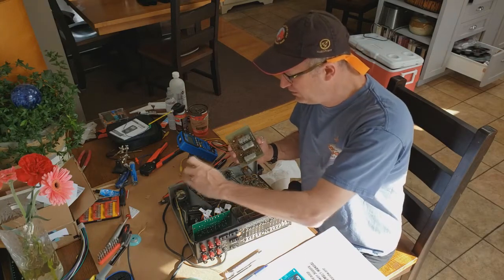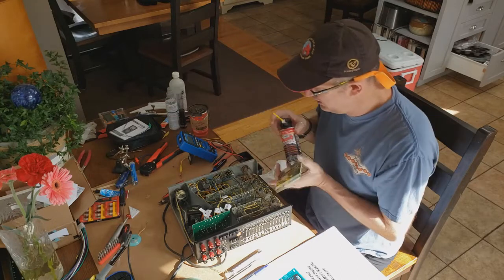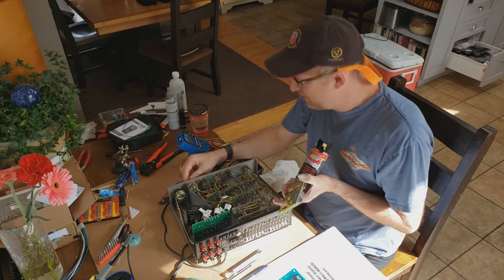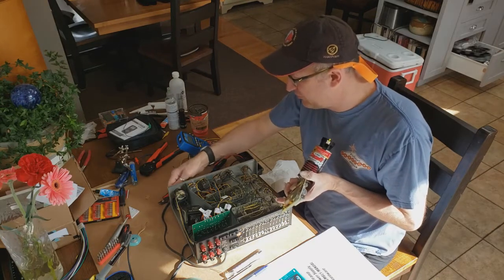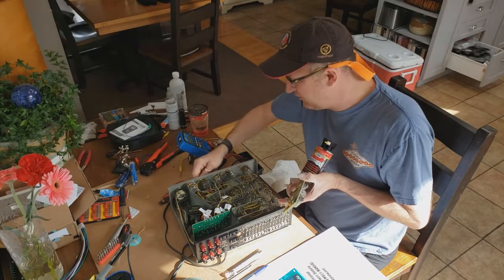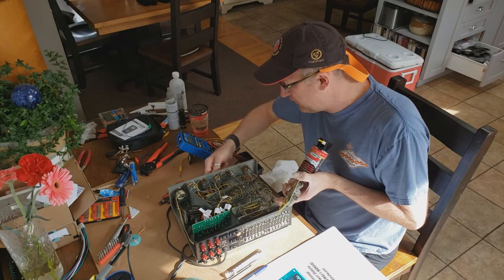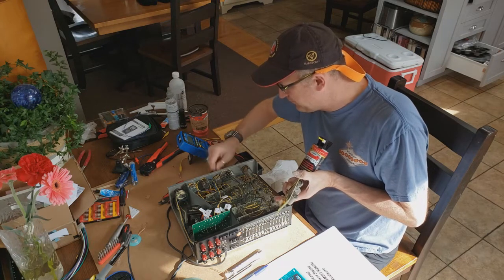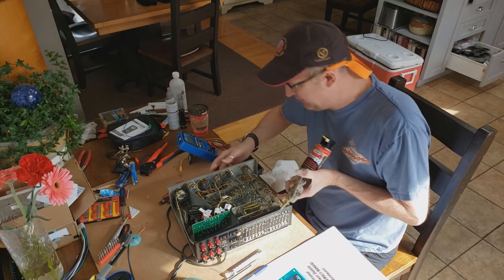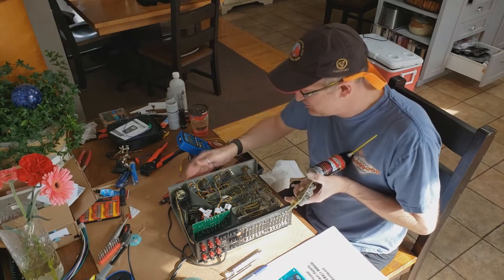The other thing I did was I went and did DeoxIT, and I basically hit all of the pots on this and gave them some really good exercise, and they look like they've cleaned up a bit. The pots actually weren't all that bad. The only thing that I noticed were really noisy were the push button switches,